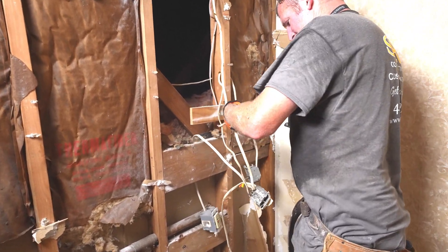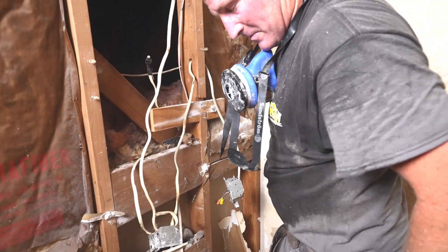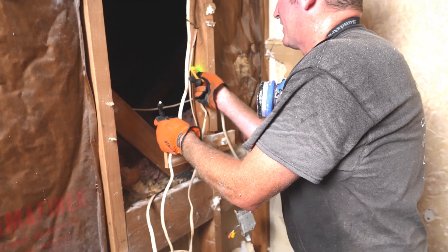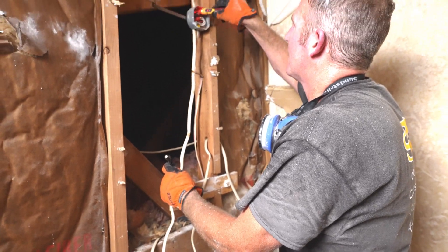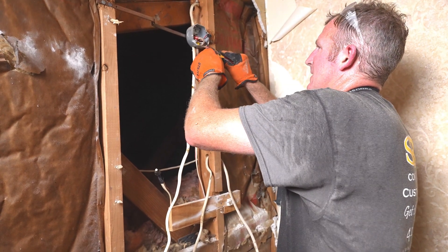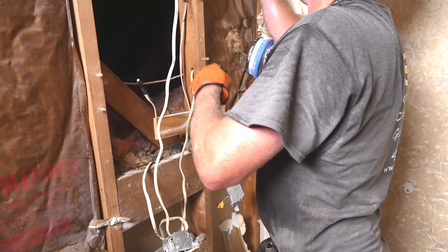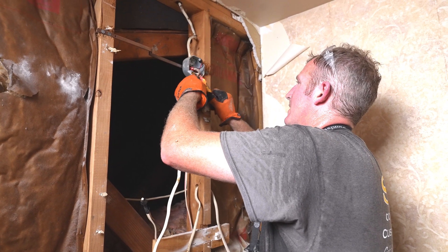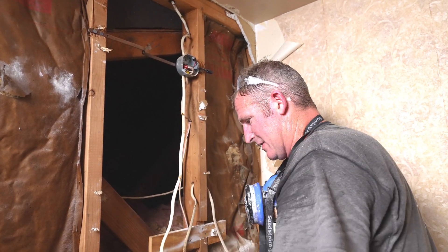So they got a cancelled end here — I don't know what's going on there. Let's just double check. So that's hot — or is it? Yeah, it is hot. So we're going to want to turn off the breaker here to this. Yeah, so that is hot, so that must be dealt with. That's terrible.